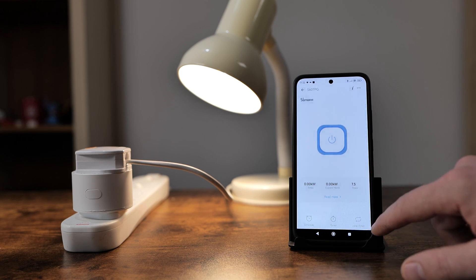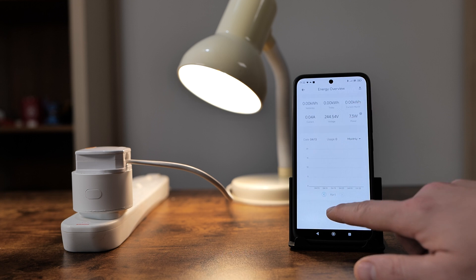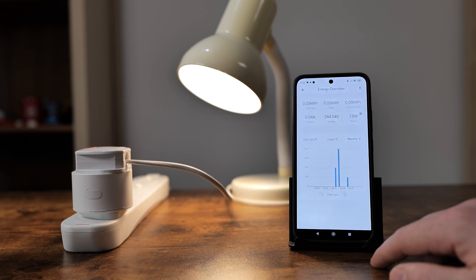This isn't my first Sonoff device with power measurements. If you go to the power measurement page, you'll have instant access to real-time data providing your current power usage, current, and voltage — and you'll be able to compare that with today's consumption, this month's consumption, and yesterday's consumption. If you require historical data, you have access to up to six months stored in the eWeLink cloud. There are some caveats: all historically stored data is aggregated, meaning whatever power consumption you had over an hour gets averaged and stored as a single data point. So if you want to know what actually happened within an hour, you'll have very little way of checking other than staring at the real-time data, which updates every couple of seconds. If you're approaching the six-month cutoff, an export button lets you download a CSV file to preserve that data — which is nice and handy.